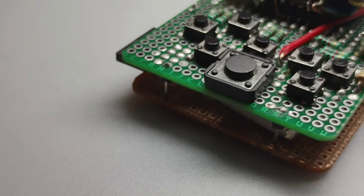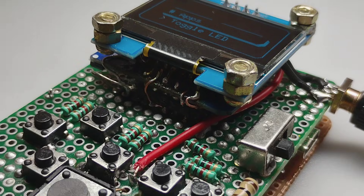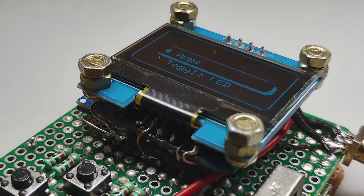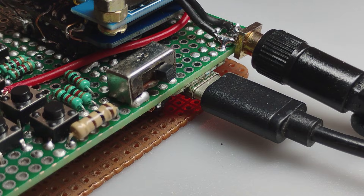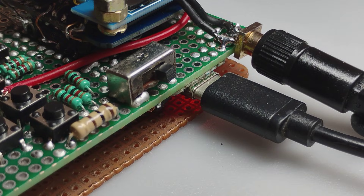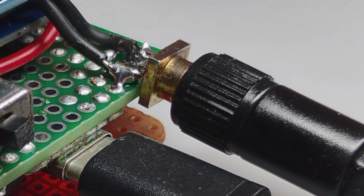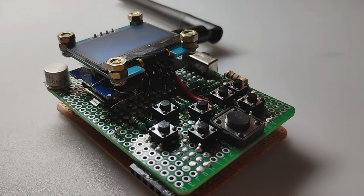Today we got some great progress. I've made a fully compatible and compact PCB which has all functionalities such as charging, a built-in battery for portability. I also modified the WEMOS D1 Mini, or the ESP8266 board, with an antenna for longer range. I've also extended the GPIO outputs from the WEMOS D1's board to the side of the board.